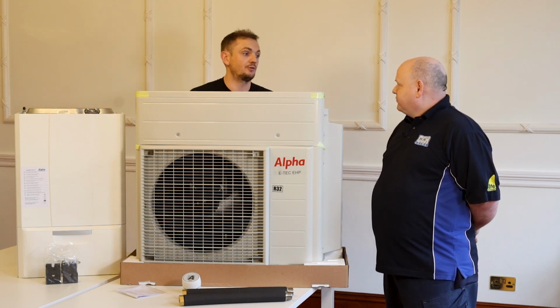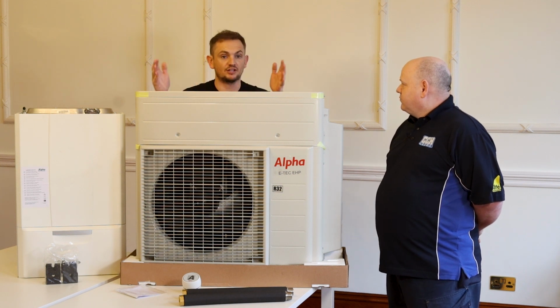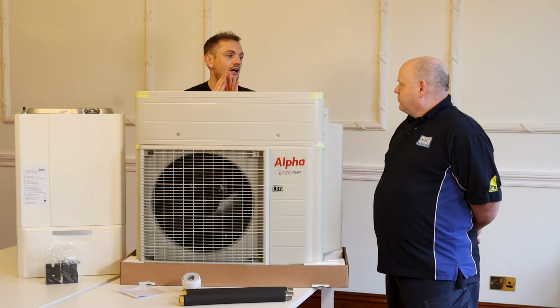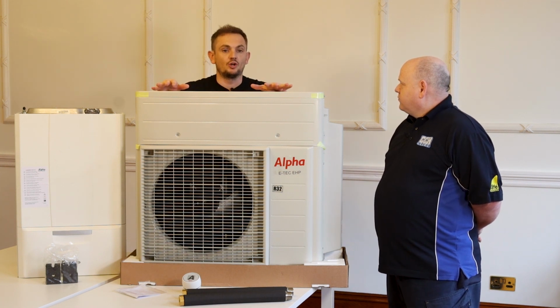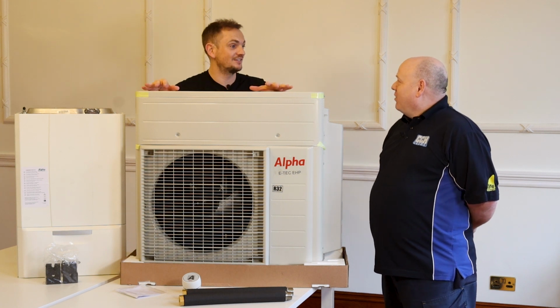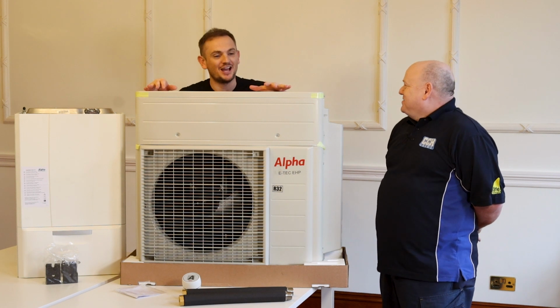The difference on your house is you've got a fairly big property, you've got 3 exposed elevations, haven't you? So you've got an adjoining wall next door, and 3 walls that are losing heat to the elements. Your heat pump needs to heat your house through your radiators internally. I don't know what you've done with them actually, but essentially your system's been designed to run at 70 degrees. I've got walls knocked down and radiators missing. Right, okay. So everyone's wearing coats.